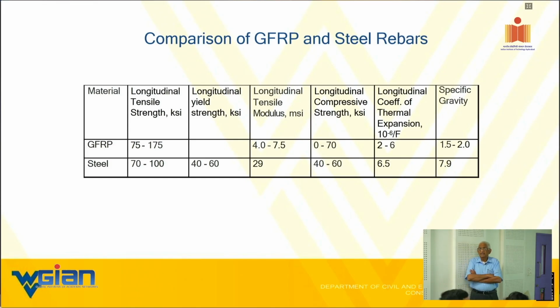So, let's talk a little bit about tension, strength, tensile strength. The easiest way, again, as a designer, not as a pure theoretician, remember that, to compute the failure strength is to consider the failure strain as something like 15,000, 18,000, and simply multiply it with the modulus, you got an answer. You see what I mean?